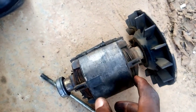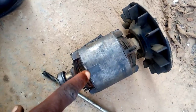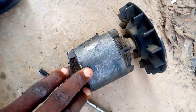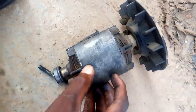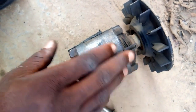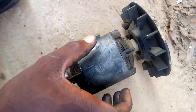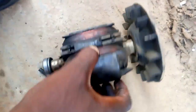To achieve lower RPM, you will use a neodymium magnet. The existing magnet here is a ceramic magnet. With the neodymium magnet, you will drill a hole all around here so that this entire area will be covered with the neodymium magnet — the south of the neodymium magnet here, and the north of the neodymium magnet on this other side.